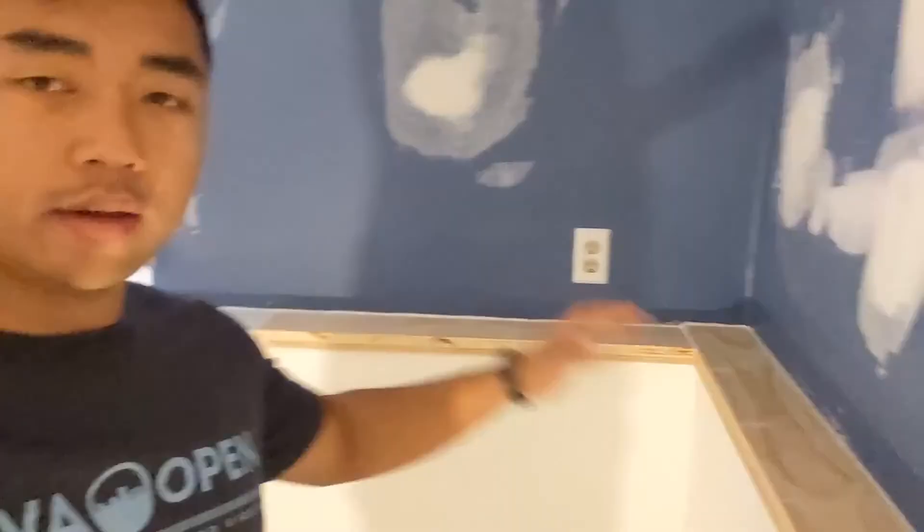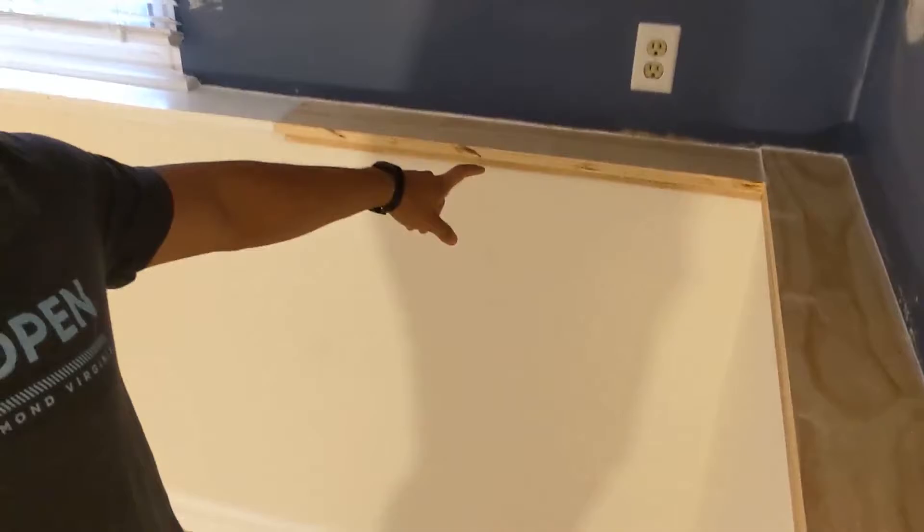Here's a quick update. I've patched those pieces — still need to sand them. I've replaced this trim, though annoyingly one side was five and a half inches and the other was six and a half, so I had to get two separate sizes of wood despite thinking they were the same. On the trim, I've replaced it and caulked along the edges as well as caulked the rest of the room. You can see that without caulk there were black gaps or shadows between the trim pieces — it's not perfect but it's definitely better.